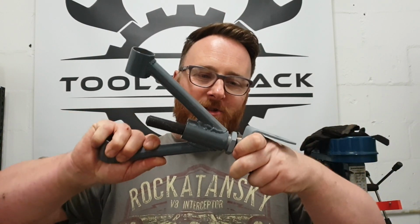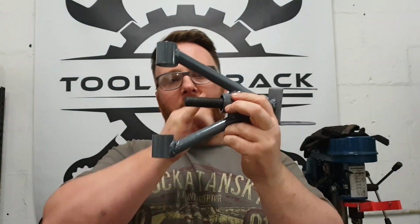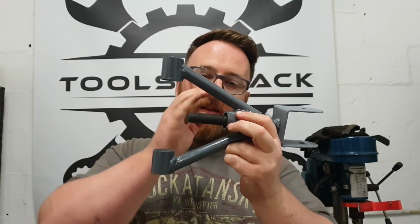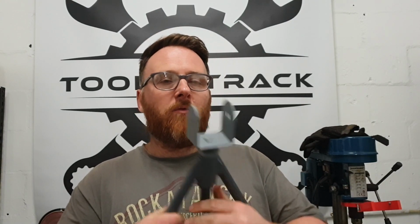Hold up lads, I've only gone and finished something. Check that out. Nice bit of adjustable upper rear arm. Yeah, we've got a bit of excess, but once I've got the other side of this threaded on and chopped down, that'll be neat as can be. What have I promised for next week? Well, that has been completed, so we need to use the same jig principles and make some lower arms. Not gonna lie, they're gonna be slightly more complex than this guy just because of the location. However, I think this will be strong enough to hold on 1.8 litres of MX5 power.